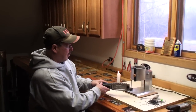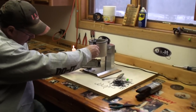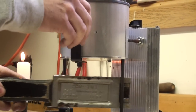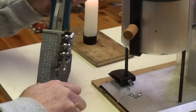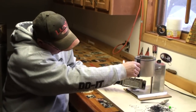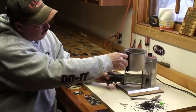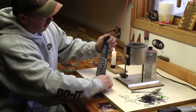The mold's quite hot from sitting on top of the pot here. What I'll do is I won't even have hooks in here yet — I'll just pour the lead right in there to preheat the mold. Normally I'll drain the lead on top of the mold like that, and when you pull your jigs out, they pretty much come out all together. When you set it back in the pot, set it back in easy — don't drop it from up high because a splash of lead in your eyes or on your arm is dangerous. I'll do this probably four or five times until I know that mold is good and hot, where it's going to mold around that hook so you don't have a loose hook in the head of the jig. See how they all stay together? It's because the mold is getting a little bit warmer.